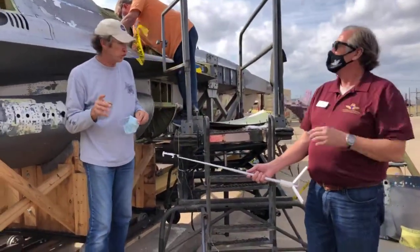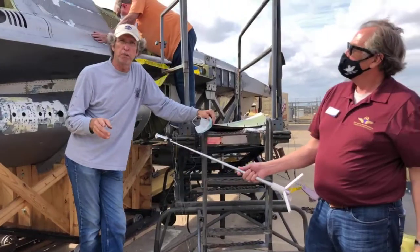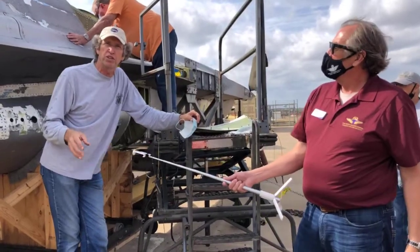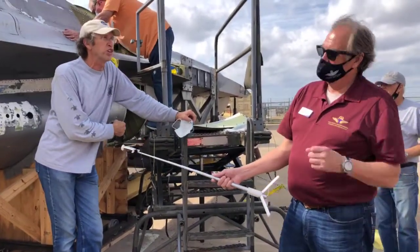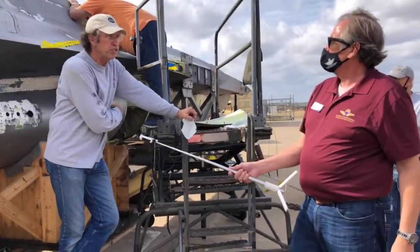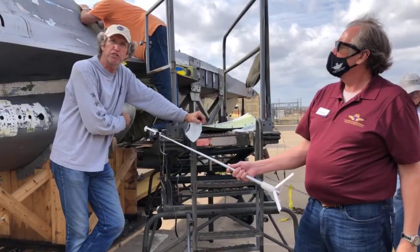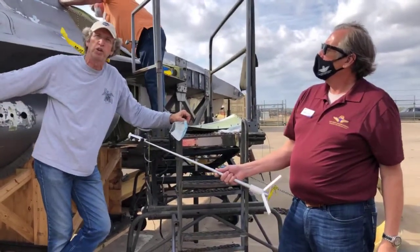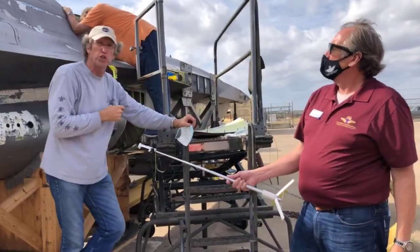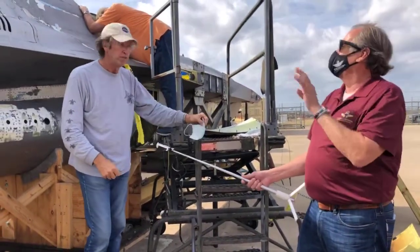The other great news is this week we got a surplus F-16 landing gear from a decommissioned airplane up at Sheppard Air Force Base. It's actually an early C model — before they bolted the landing gear doors. One of the things we checked today was whether the fittings still fit the YF. The next step after we get all this done is to put back in hundreds of nuts, bolts, rivets, and fasteners, then pick it up with a crane out of the steel tool and attach the landing gear. It'll be the first time it's on its own feet in 40 years.